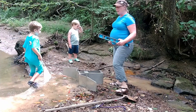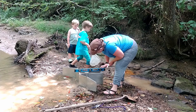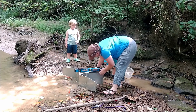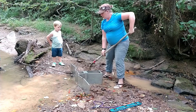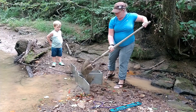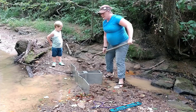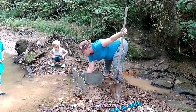One of the key things we have to do when installing a flume is make sure that it's level front to back and from side to side. I like to check it every once in a while as I go and adjust. Right now I'm packing behind the wing walls to ensure that all the flow is going through the flume. I have a little bit of sediment that ended up in the flume, so I'm going to clear some of that out.